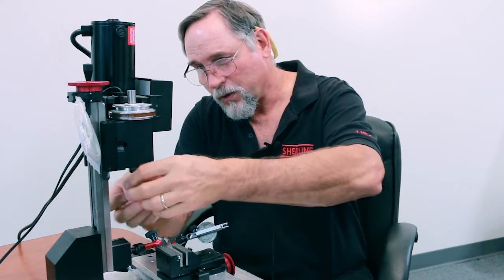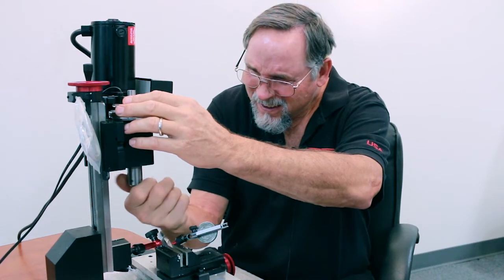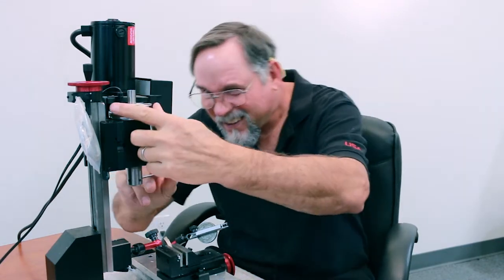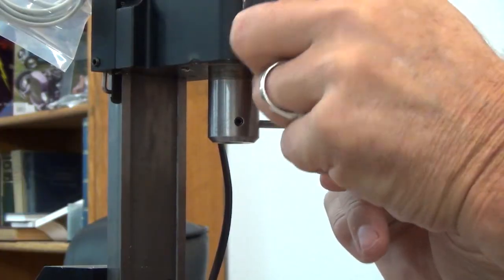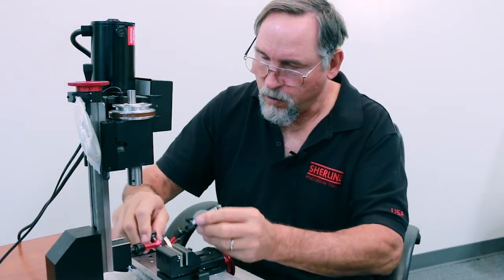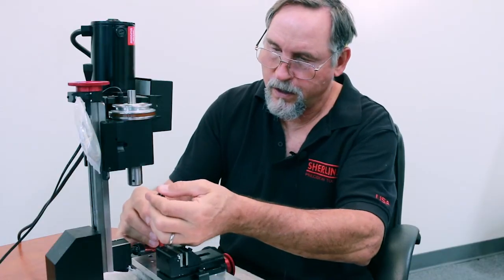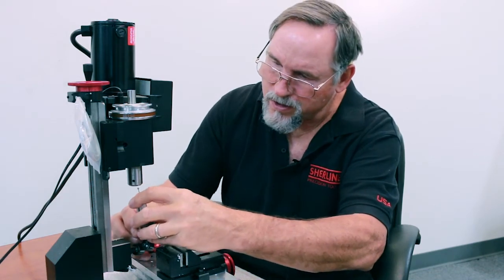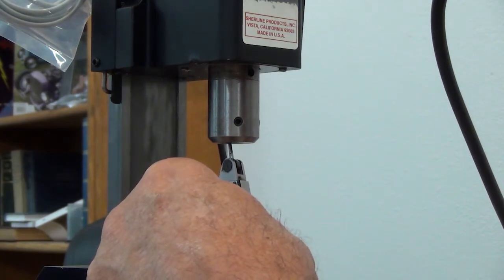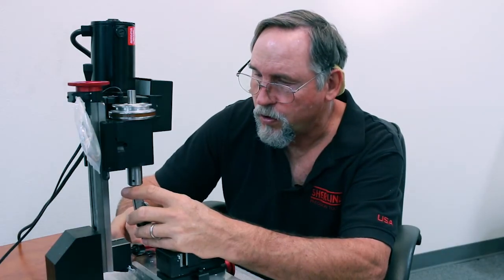Okay, I'm going to wipe off my shoulder here. Put my end mill holder on. And you want to lock it on pretty snug. That guy's on good and snug. Now, I don't want to check the outside of my holder, I want to check the inside bore. So now with the indicator, I put my indicator so it's straight like so, and I come in and I also want to be at an area that's below my cross holes or my set screw hole.